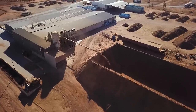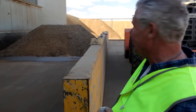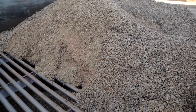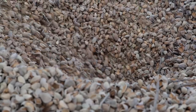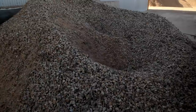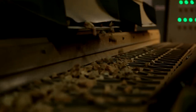So this is basically the start of the process. They drop them in here, either out of the trucks or out of this big front end loader that they got here, which is kind of groovy. They've got a big pit where they drop the almonds in. And obviously they come out of the field covered in sticks and sand and a bit of rock and all sorts of carry on, which is a bit of a worry. So they've got this awesome setup down here. They've got some augers in the bottom of this pit, and it goes up that elevator. And up the top of there, you've got a de-sander, a de-sticker, and a de-stoner.